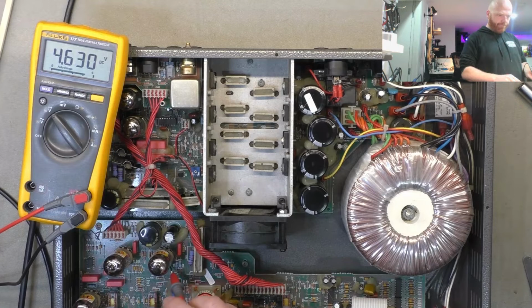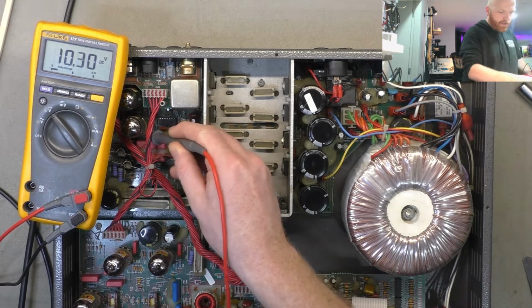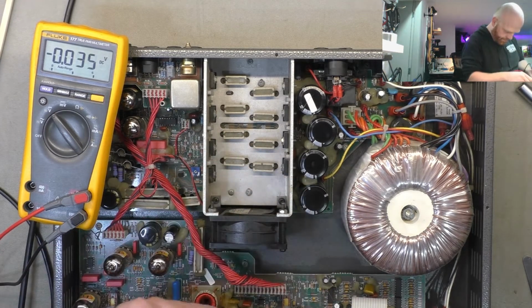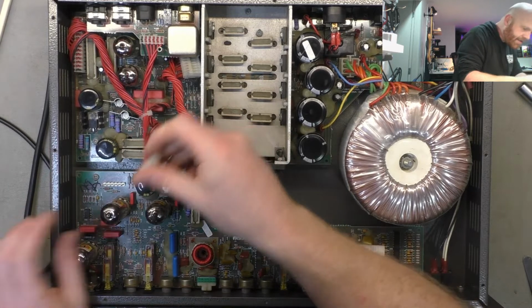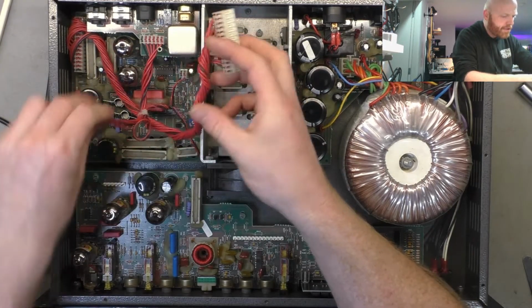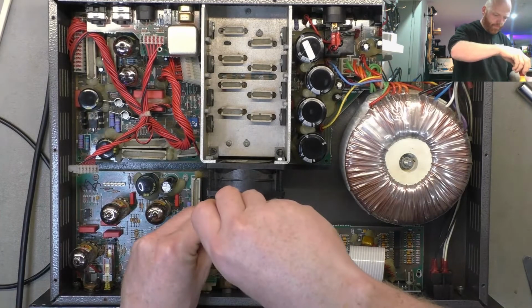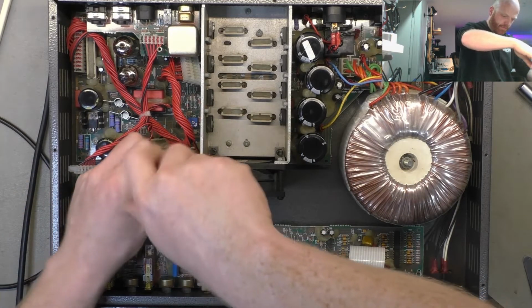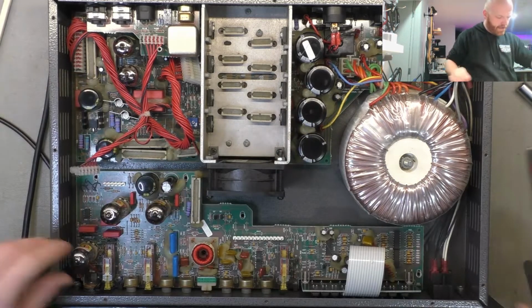So they're only preamp valves, but they're still valves. So we'll check there's no residual high voltage anywhere on this board, or that one. 10 volts, 3.6. We should be right. No visible burn marks, that's good. Looking pretty fresh. I'll get to removing this board. Remove all the pot nuts on the front panel, as well as the input jack, which is just floating around free now.